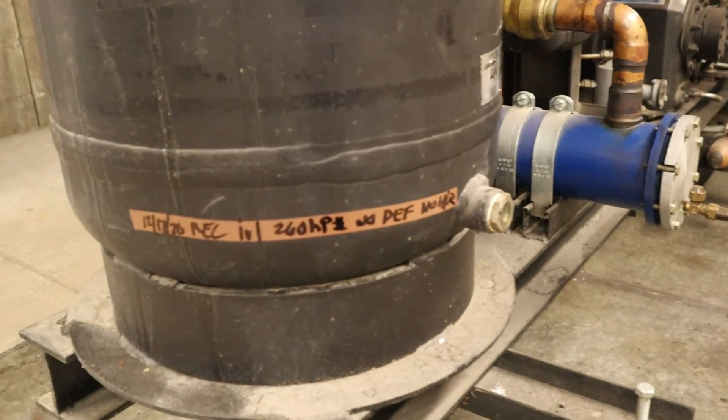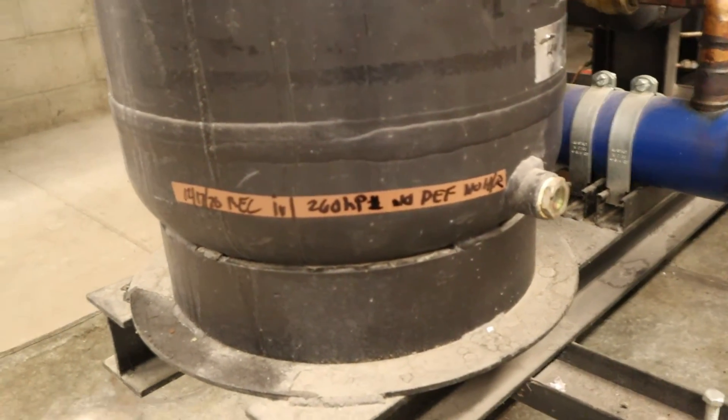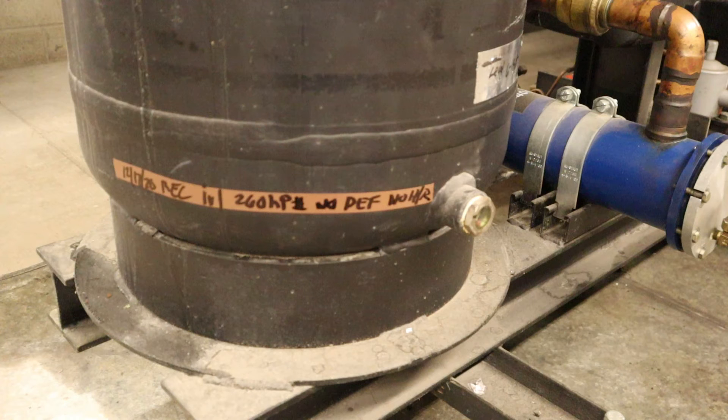I would call this five percent. A good receiver level is ten percent above the alarm set point — so if your alarm is at ten percent, you want it at twenty percent. Usually other targets like Walmarts are thirty to forty percent. That's what's out there — every account is different but that's usually what I go by.